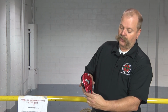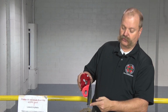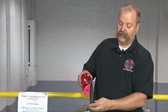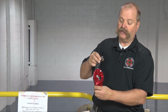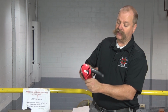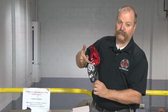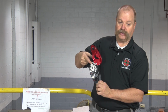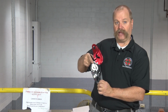With the cover closed, you can see the operating handle all the way down in what would be the clockwise position, where the handle is pointing down towards 6 o'clock. That is the store and lock position. As the handle rotates counterclockwise and comes up towards the top, this becomes the beginning of the operating position. In the lock position, if we open the cover, you'll see there's a very little gap right in this area where the rope is going to be placed. That gap pinches or clamps the rope, and that's where the brake, or lock-off, function comes from.